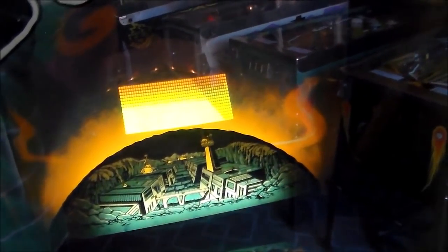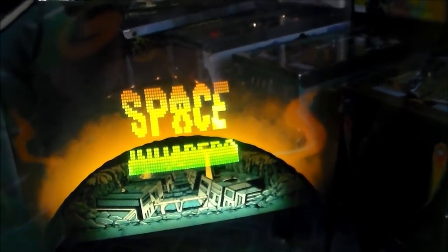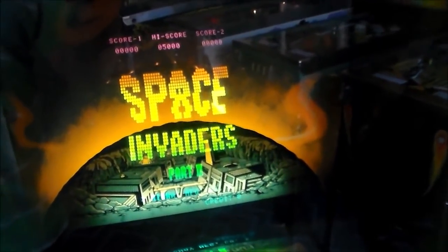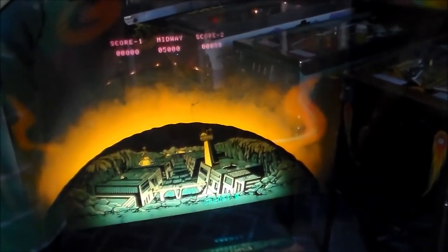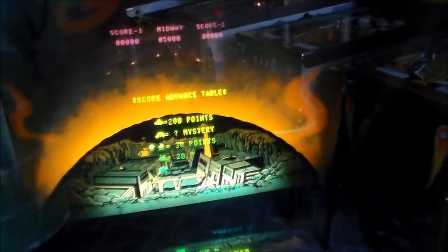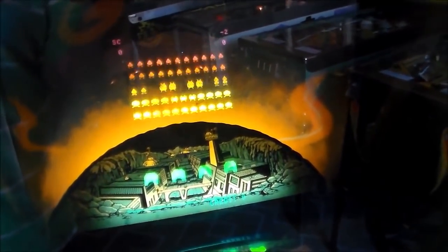So I take it in the back room, start looking. They've obviously replaced two transistors, and that was all that it looked like had been replaced. They had replaced the two transistors with the wrong damn transistors. Weren't even close. They had gunk on those two transistors that looked like oil or something. Took the two transistors out, put the right ones in, bam, the monitor comes right up. That's one of the weirdest ones I've done, folks.